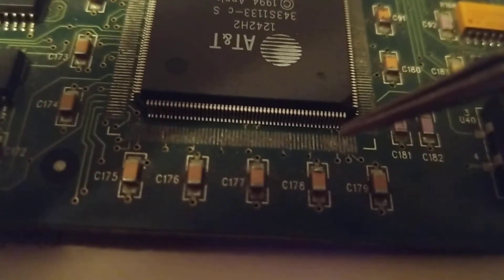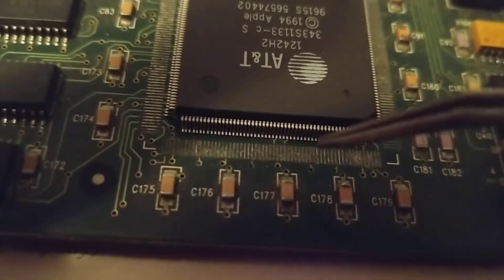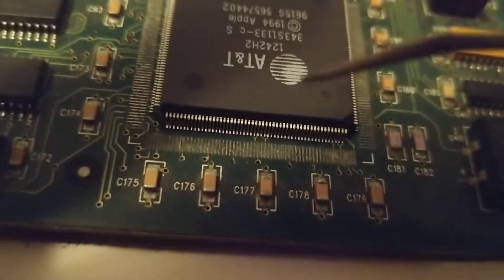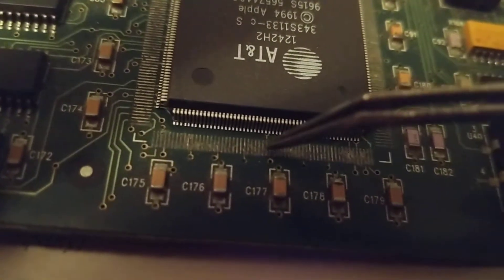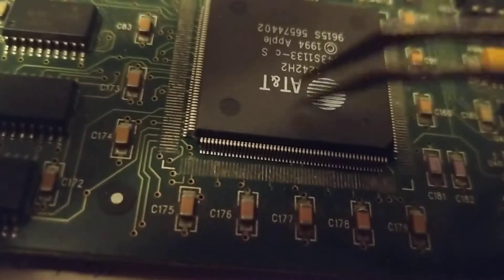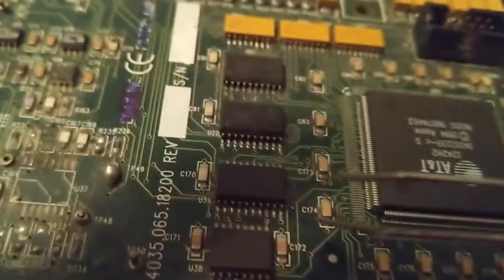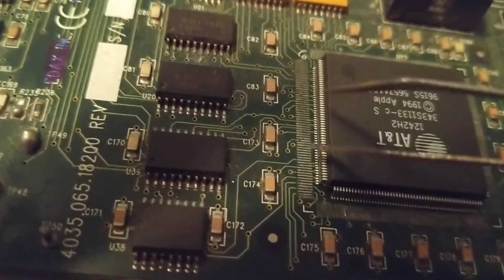So I had to reflow them — meaning resoldering them. But you have to resolder them so carefully; the precision here is like the hand of a surgeon, I am not joking. There's a difference between soldering this and soldering something larger — you cannot short two adjacent pins. If these two pins become shorted, the whole thing is damaged. We're talking about 100–200 pins per chip, therefore you have to be careful. Only professionals should do this. There are different types of chips on these surface mount computer boards and instrument clusters — these pins come up.